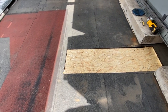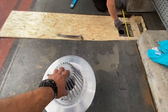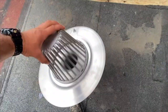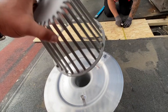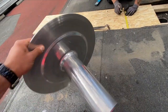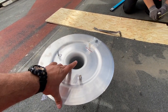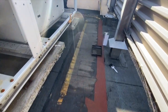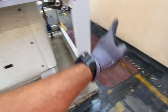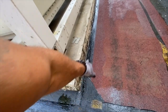We're going to cut out a hole and fit the outlet. It's just an aluminium outlet with a grill — nothing too fancy, but it was £360 plus 23% VAT. We have the area nicely primed. Before we start applying the Lava 20, we're going to come in with a PU mastic and fill any imperfections in the concrete. It's very important to squeeze out any excess primer from the roller so you're not applying too much in one place — the less the better. Too much primer will just peel off; the idea is a thin skin.